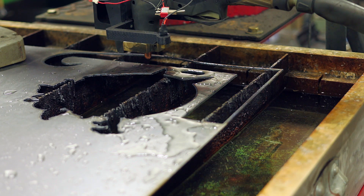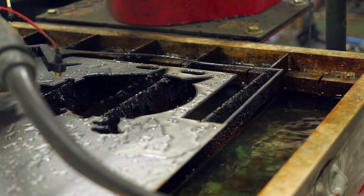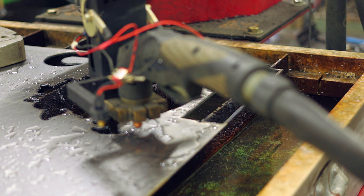So that actually looked really, really good. There might be a minimal amount of bevel, but not enough that I'm concerned — not for arc pieces or anything like that — and almost no dross. So I bumped it up to 2,000 millimeters a minute just to see where we'd land. Having this much water in the water table, you can see how much splash there is, so you've got to watch it a little bit — you don't want to soak the ArcDroid out. So 2,000 is a little bit quick, so I'm going to stick with around 1,800. There's almost no dross and it looks pretty good. There's a little bit of bevel on the corners, but I think it's an acceptable amount. So 1,800 is going to be it for the 0.9 nozzle at 35 amps.